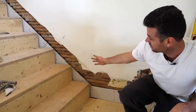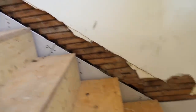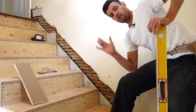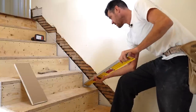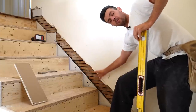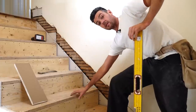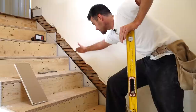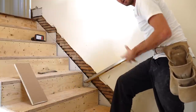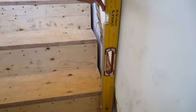Welcome back. I should have taken the thumbnail photo before I put this board on, but I wasn't even planning on making this video. It starts down to the studs. What you need to know about a stairwell is it should be really rigid. I thought using quarter inch was not going to give the rigidity needed, so I put 5/8 here because it's very strong and rigid, and as you can see it planes out pretty close — in some spots it's almost perfect.